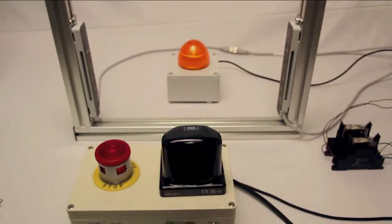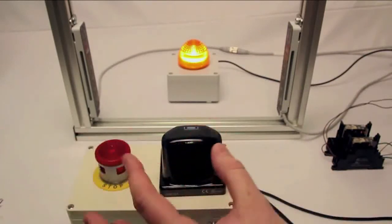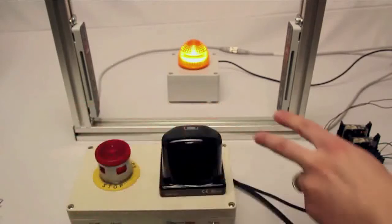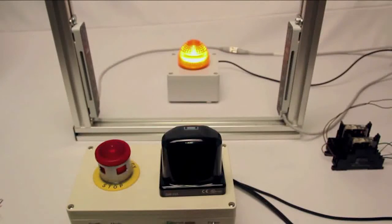It's all fed into the same safety circuit — there is no extra controller needed. I can have a whole array of extra peripherals that all need to do the same thing, and they all go straight into those two safety inputs to shut the machine off. It's extremely simple and it saves panel space, which is a big deal when you have a smaller machine that can't accommodate a large controller.